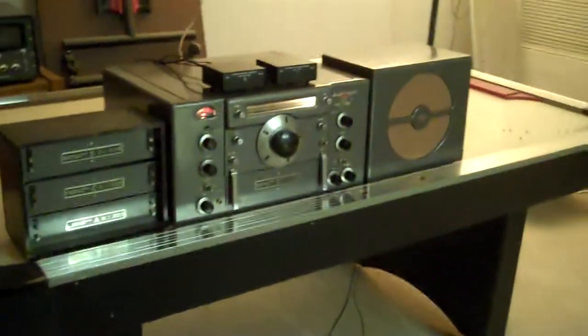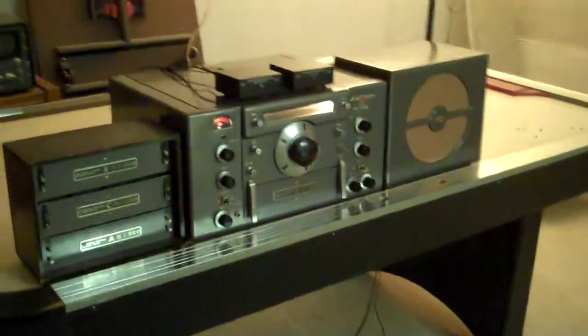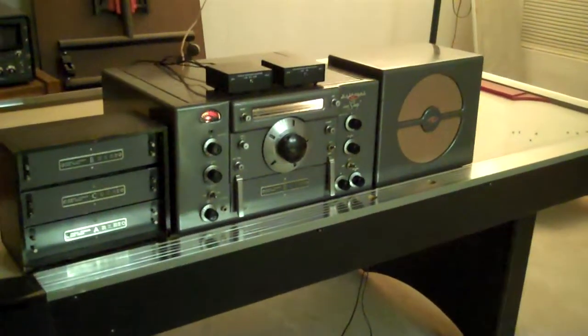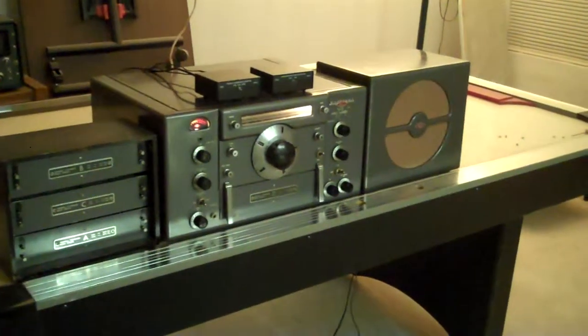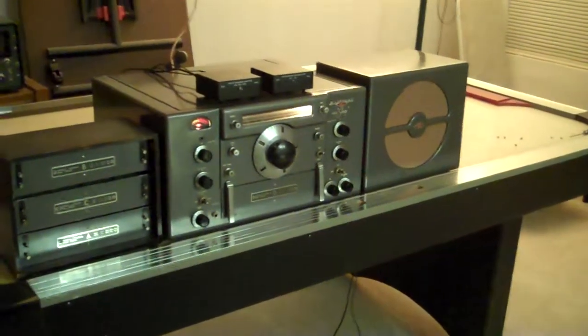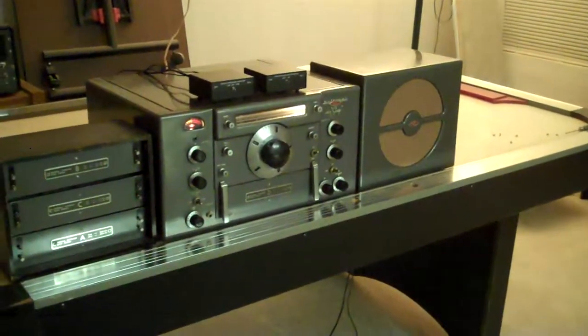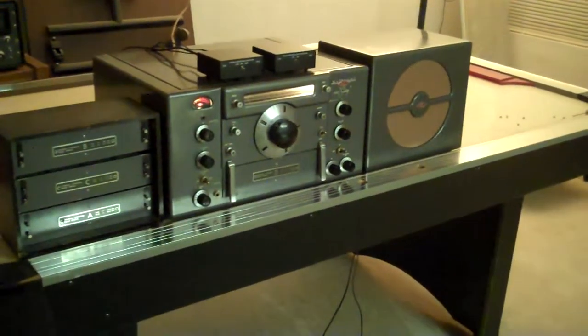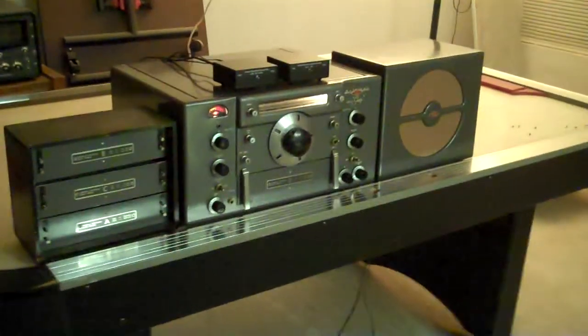You will have to have the radio at exactly 455 KC, so if your radio is out of alignment, you're going to have some issues with tuning people in. I just used a signal generator at 455 and did a standard IF alignment, and then it started working.